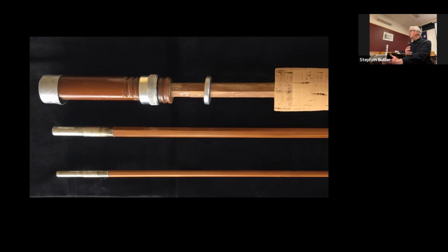And so I actually managed to strip it. It's totally crazy, to take all the varnish off it to then be able to refinish it into a rod. So are you using any chemical or is it physical? I used a steel ruler, 1 foot long. It's like a big cabinet scraper, and I just sat the strips on the bench and worked them very, very carefully over a few hours and turn it and do it again and turn it and work up the rod. And then finish it off with the finest steel wool and then re-oiled it.